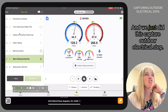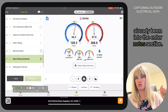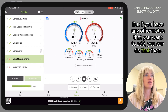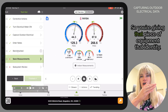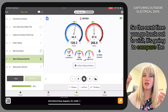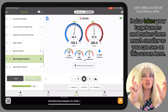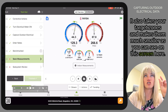We just completed the capture-after-electrical step. The Enter Notes step had a green check because we'd already been into that section, but if you have any other notes to add, you can do that here. This is also where you benchmark the equipment — giving that piece of equipment its identity. The next time you go back out to visit, it will compare the operation from the last time you were there, and it makes the target zones much smaller, as you can see on this screen.